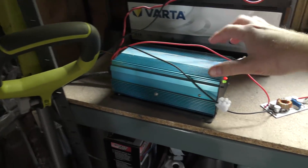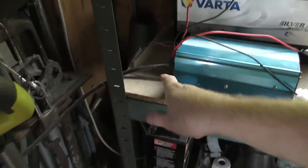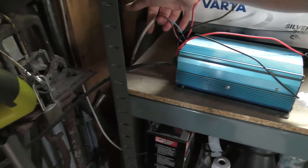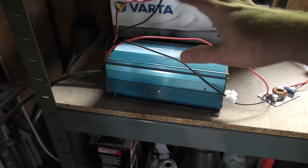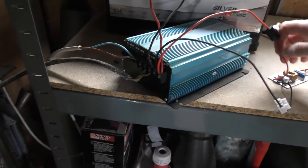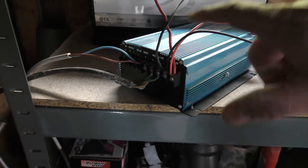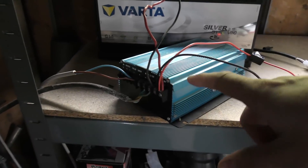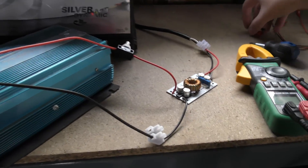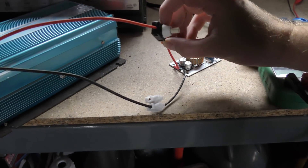Let's just see how it's doing in here. We have this wind and solar hybrid charge controller, so it takes in charge from the windmill and the solar panels, and that is put into the battery. It does have an output as well, but I found it doesn't really work. The output is good for making sure the battery is not drained too low, but when I attached the DC-to-DC converter to it, nothing happened. So I've hooked it up in parallel with the battery — not ideal — and I've added a little switch so I can turn it on and off.